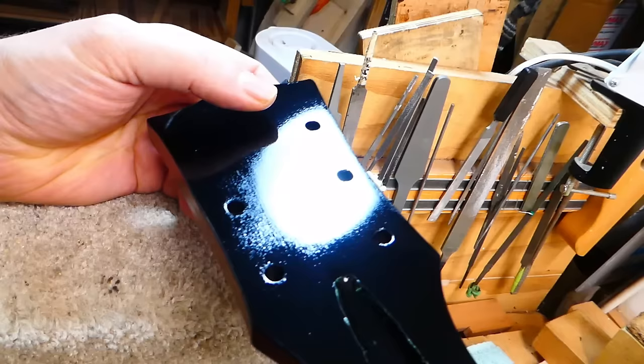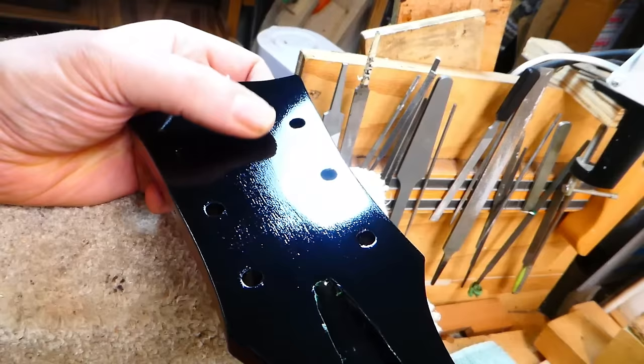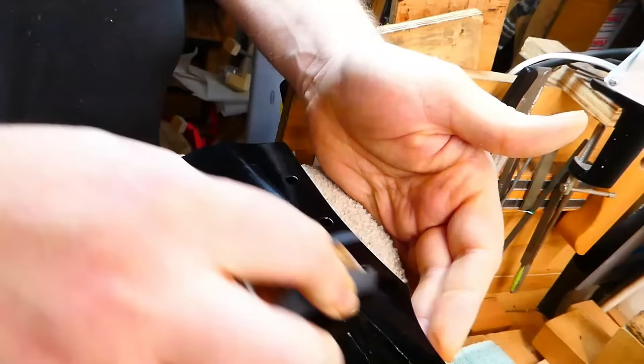After putting some black on the headstock, I went ahead and sprayed four or five coats of clear lacquer. This veneer I used isn't quite as closed-pore as the black dyed pear wood I'm used to using — they were out of it the last time I went shopping. So I'm not sure what species this is, but you can see that after it's shrunk back, there is some slight texture. So I'm going to have to give this a preliminary flat sanding with some 1200 grit paper before I put the decals on.